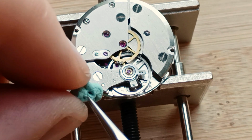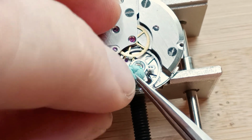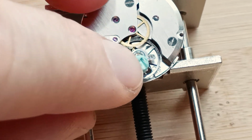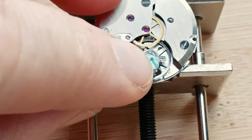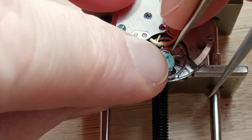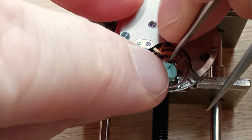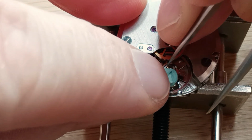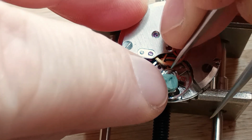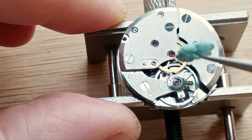And now this is difficult, I would say. This type of shock resistance on the balance wheel and jewel. Here you have to be careful. I think the Incabloc are the best, but you can cope with this also. The Vostok watches have similar ones too. I don't know why that is. Let's remove it. You have to just turn this spring, like I'm doing here. I will show you in a bigger magnification later when I do the assembly. That's the spring, pretty small.